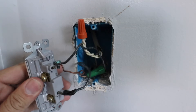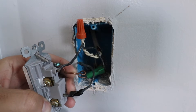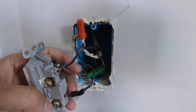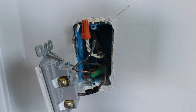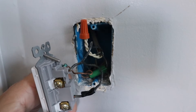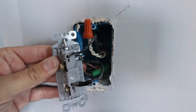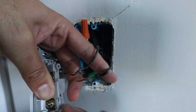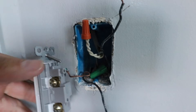Now that we know what our wires are and we've got them appropriately marked, we can remove them from the existing switch. The other wire we have here — this unshielded bare copper wire — that's our ground wire. In some cases it's going to be a green wire, so ground is either green or unshielded copper. Your neutral wire is always the white wire if your wiring is wired correctly. Now let's take off these existing wires. Our wires are back-wired, so we need to put something into these two little slots to release the wire. We've got both wires released. I like to fold the hot or line wire down and the load wire up. Now we've just got to remove the ground wire.